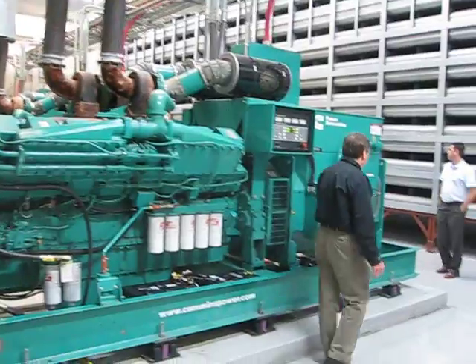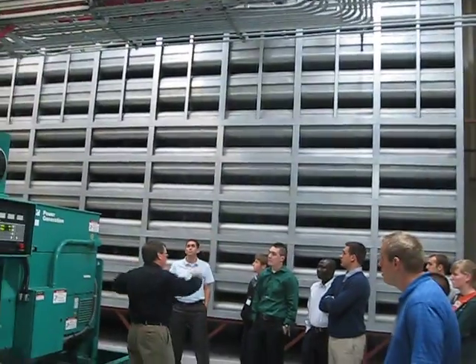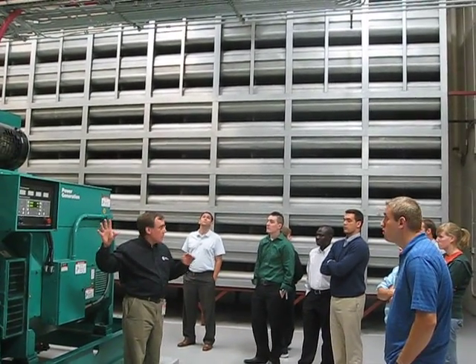In order to get that air through the room, you've got to have air inlets — big openings — so you have very low restriction, because these fans need low restriction.